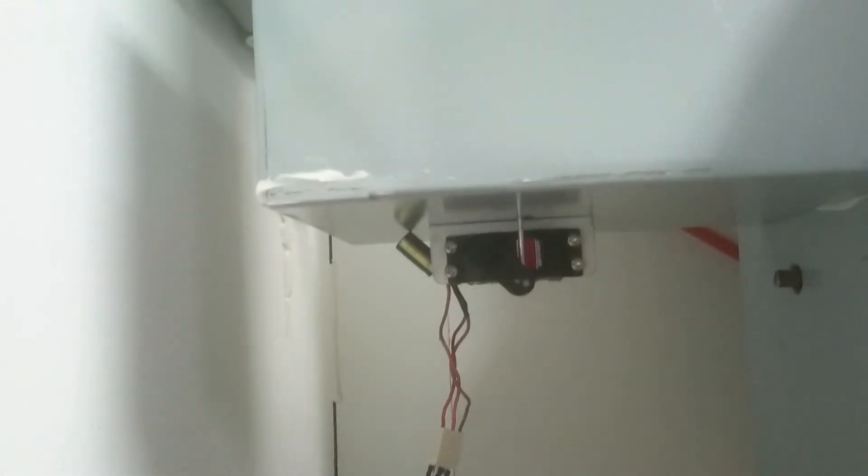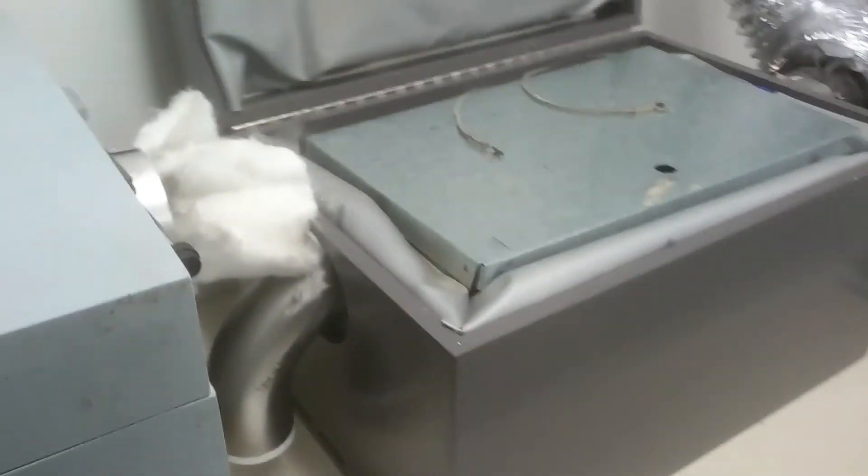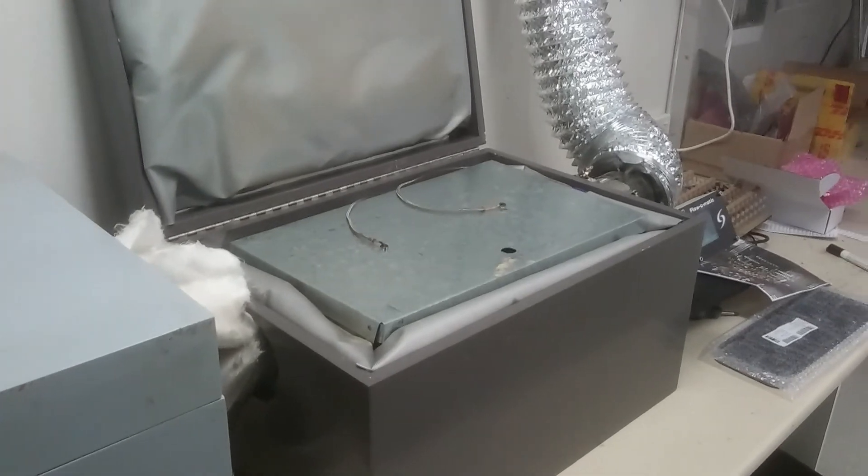We had these arrangements — these sort of pedal valves — and these open and close. They did okay; they weren't too bad. We ended up making a wooden box. There's an RC servo on the bottom of that which lifts it up inside. Look, it evolved over time — it works, it's good enough. We've made thousands and thousands of boards with these things.